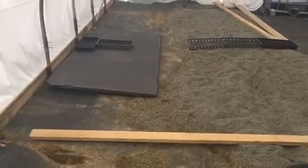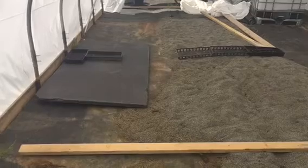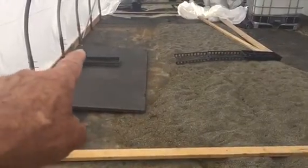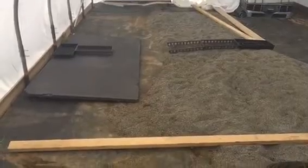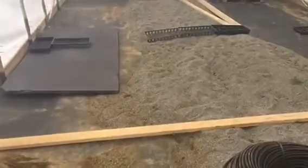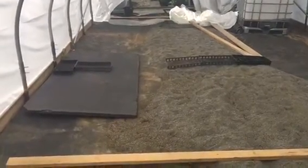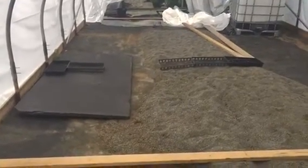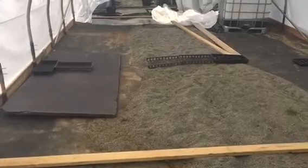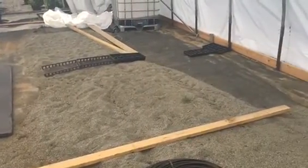That will be kept at somewhere between 65 and 70 degrees to pull growth out of the rooted stems into the cuttings — that's what all these greenhouses are for. There will be two circulating pumps: one on the first half, one on the second half. In this section between the bows where these two-by-fours are is roughly where we think we're going to put the hot water heating systems, circulating pumps, and electric control boards. This end of the nursery just to the left has all the pumps and wells, so we'll be able to tap in there for water.